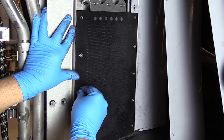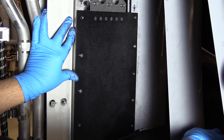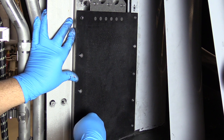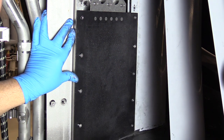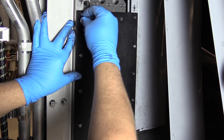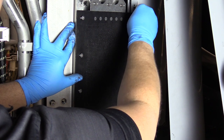While we're installing the fasteners, a couple things I want to note: there are 4 extension panels, 2 at the lower bifurcation on the left and right side, and 2 at the 12 o'clock strut on the left and right side. And each of those has a torque sequence. The torque sequence will not be the same for each panel. However, just follow the spirit of the torque sequence method, and your panel should seat correctly.